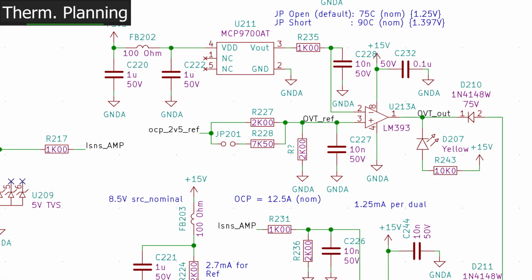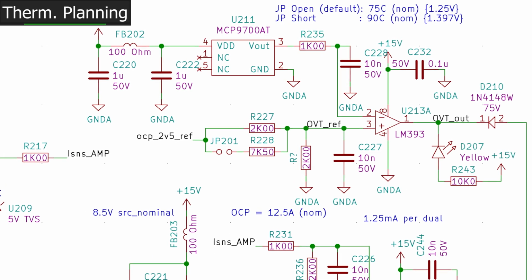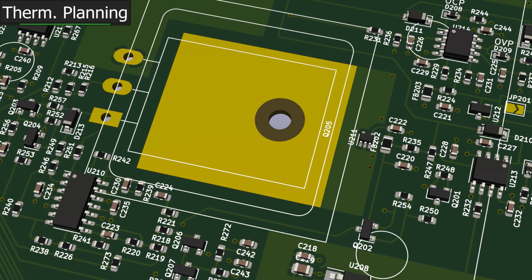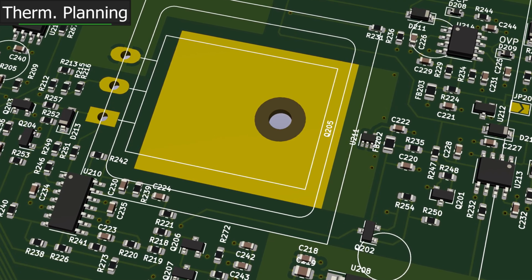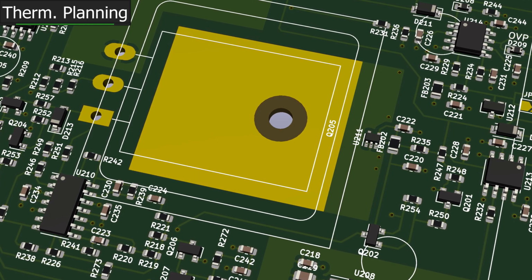Thermal limiting is another one that we had to do, over temperature protection. I alluded to it. Basically, I've got these copper shims. We could have just used shims, FR4, really anything, but I got this copper plate, which will add some thickness. The FET isn't quite exactly the thickness of a CPU socket plus the integrated heat spreader and all that stack. It's not quite the same. Unfortunate that it's not. So we're going to attempt to solder pieces of this copper plate onto the PCB and then put a thermal pad on top of this, just like there will be on the bottom. That's the intent. Hopefully it works out. Guess we'll see.